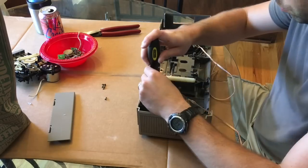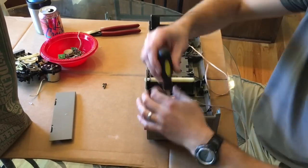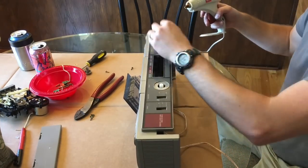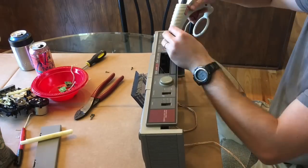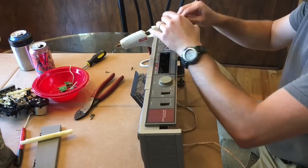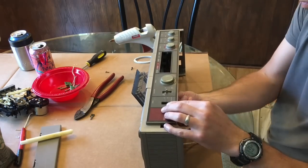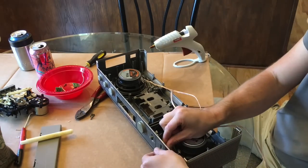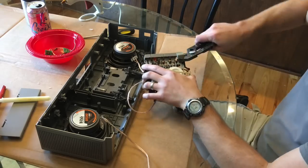Last time I used hot glue for fixing a lot of the components inside, and I wanted to come back to that because it works well until you leave it in a hot car and the hot glue re-melts. There are times where screw holes don't line up — in this case I could only get two of them in — so it is important to use mechanical fasteners to affix as much as you can. I still used hot glue for a lot of the buttons, but I am going back and replacing some with a more permanent adhesive, because when it gets hot enough the buttons can actually melt off.